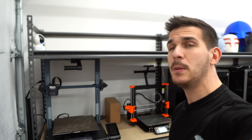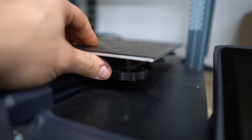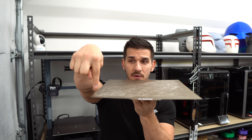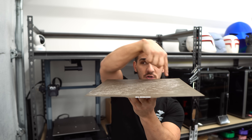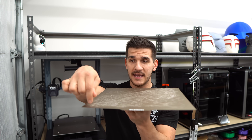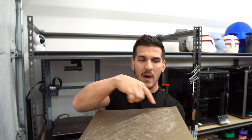I actually found myself using a sticky note paper trick to level a 3D printer a few weeks ago and realized I hadn't done that in months. But if you're still using older bed-slinger machines like the Neptune 3 Plus, Neptune 3 Max, or old CR-10s with leveling adjustment knobs, it's something to understand. The actual word for it is tramming. A 3D printer can print upside down — what you're actually concerned with is the nozzle distance being the same from corner to corner. If that's off, you'll get weird prints or adhesion issues. It should be called tramming — you're making sure the nozzle distance is uniform so a square sticks the same way across the whole bed.